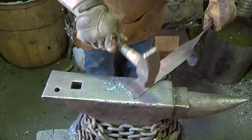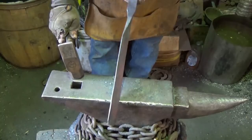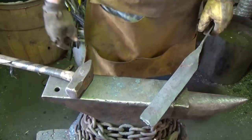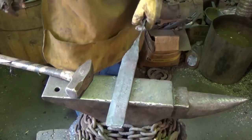I think I am just going to go ahead and harden it now. I won't even bother doing a rough grind because I did that with a hammer. In my ignorance, I don't know why I couldn't just go ahead and harden it. So I'm going to normalize two or three times just so we don't crack, and then I'll harden it in the oil. Then I'll just temper it over the forge. I don't want it too hard, but I think having a little hardness in there is going to help.